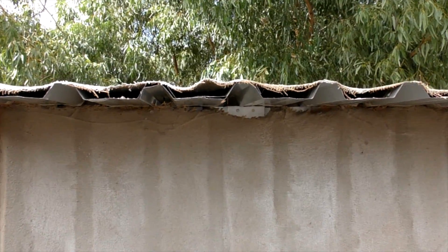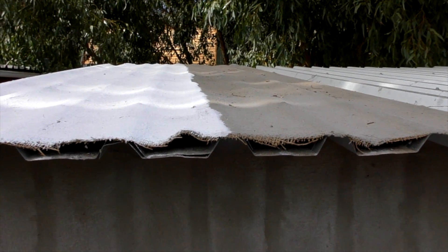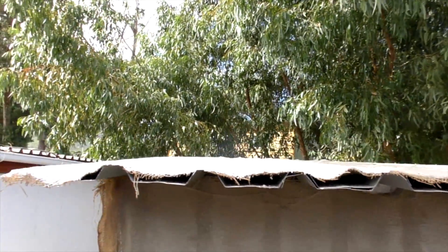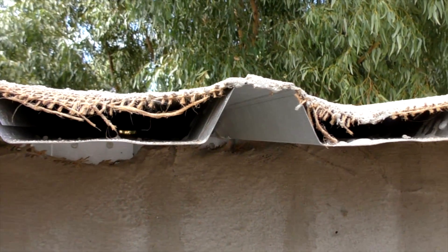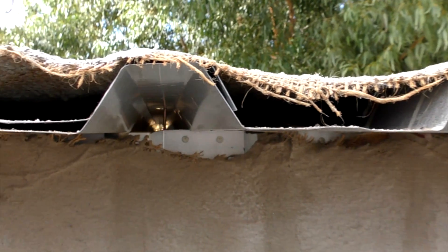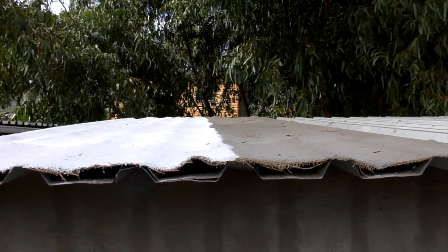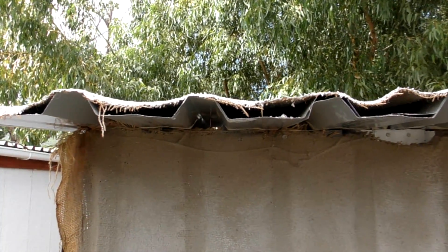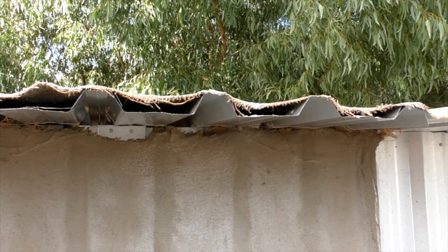The roof is a critical area for keeping the temperature down. Here we have hessian glued onto the roof, plastered and painted. The roof gets solar heat most of the day and is responsible for a lot of internal heat. You can see the long air cavities created by the ThermaTrap system — these tubes allow the hot air to escape and keep the roof cool. Another big advantage is it dramatically reduces the cold bridge effect at night, where the steel sheeting is not in contact with the outside air. This massively reduces condensation and heat loss through the roof and wall.